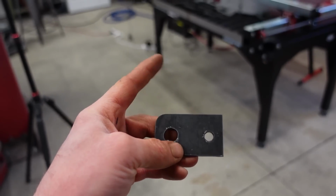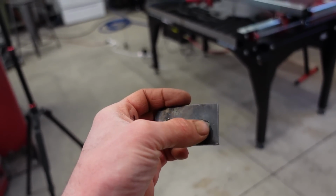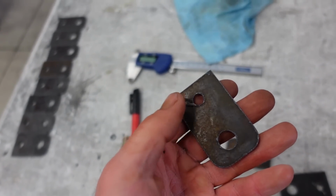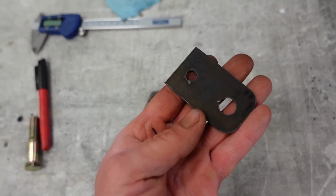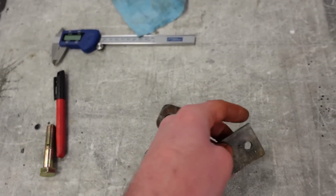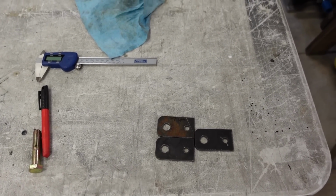Another thing I was doing is in that post processor, you can slow down a radius. So I had these holes slowed down, and I think that one I had it sped back up, and that's why I had a little more dross. This one I slowed back down. You can see just a little bit around that hole. So I think I'm happy with that. I wrote down all my settings for 1/8 inch plate.